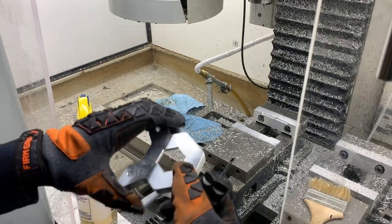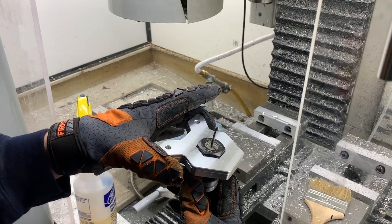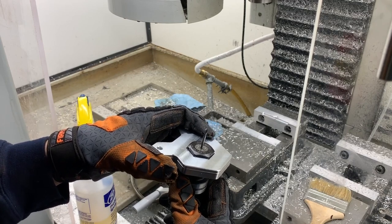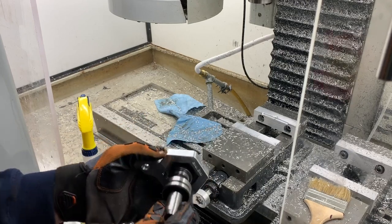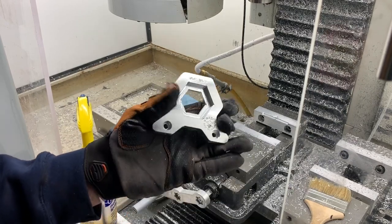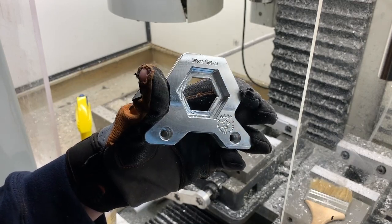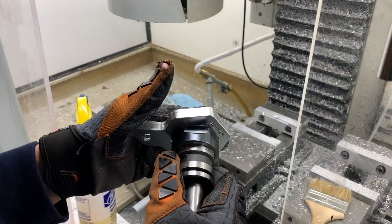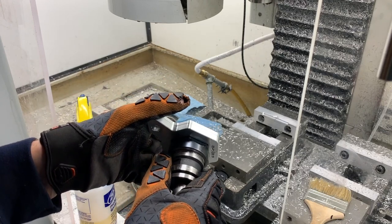This is the idea, is you can stick one of your ER collets in there and it'll hold it, and there's just enough of a clearance. I think I put 2 thou clearance on there and that fits really nice, slips just right in and out. Then the idea is you can just take your wrench and give it one of those or tighten it up, and then these two will be the bolts that I use to put through my workbench toolbox. Just so you know, we didn't cheat, here's the 32 as well, and it just snaps in like magic.